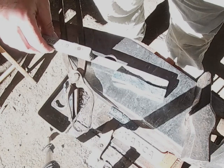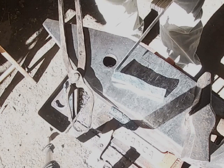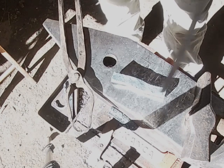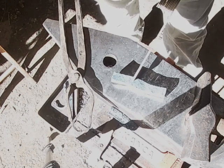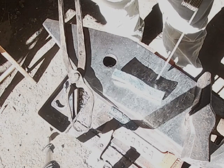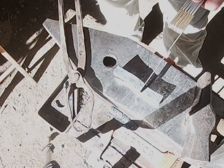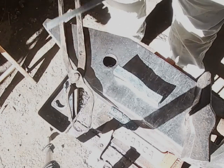So I hope you can see this. In our endeavors of doing this, we started at four inches, we've upset this about a half an inch, and it's mainly been located right here in the center section. This side upset a little bit more than the other — it isn't going to hurt anything. I mainly needed mass right here in the center. So I'm going to go back in the fire and start forging from here and from about right here, and I'm going to start forging out our tines, which will bend and then eventually stick into the meat.